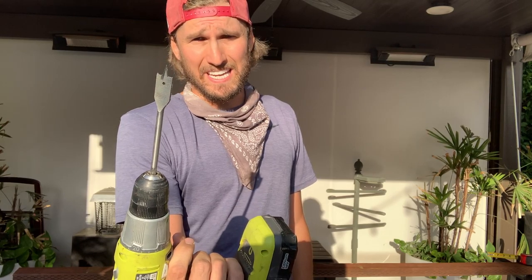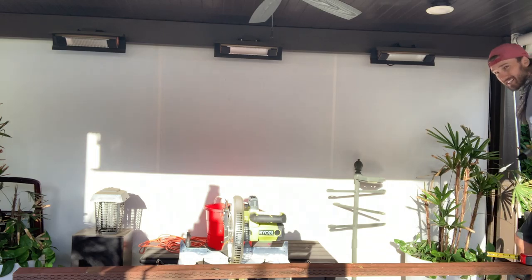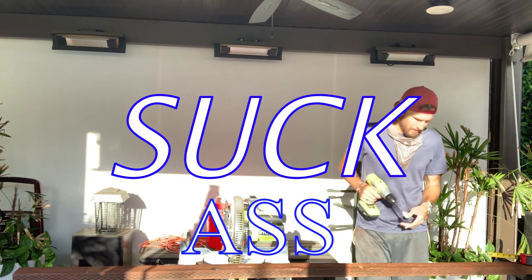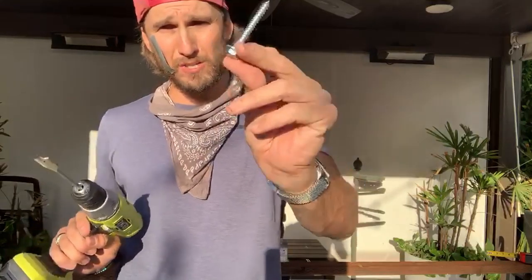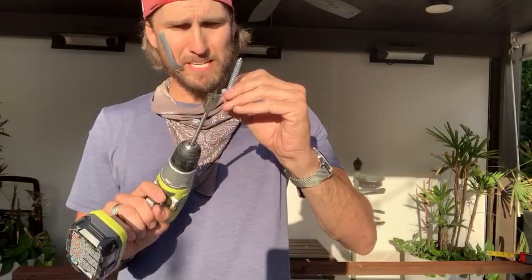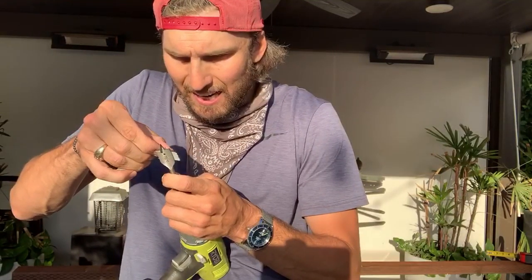I really need a masonry drill. Now that we have our pilot hole drilled, we'll put our anchor into the wall — and now it's in there, ready for our lag bolt. Got the second pilot hole drilled for our anchor. Now since I'm countersinking this, because you don't want your boards laying against the head of a lag bolt, the very first thing you have to do is drill the countersink into your 2x4 first. If you drill your pilot hole first, it's just going to spin the countersink.